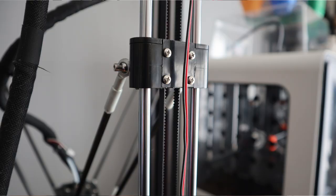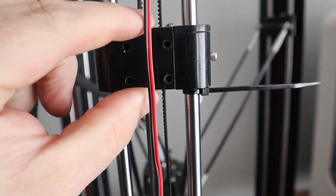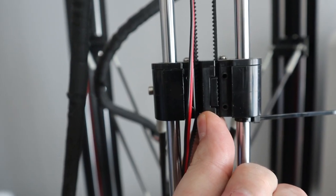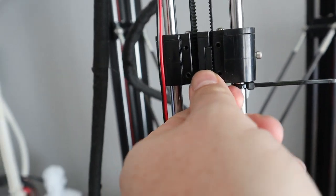Once that is done, there are four screws facing your direction. You're going to need the Phillips screwdriver — remove all four screws, but be aware they are pretty tightened into the plastic, so take caution not to damage the screw head. Once all screws are removed, you can remove the black plate. This is both the easiest and the hardest part, because you have to remove the timing belt. On one of the three carriages, the timing belt was pretty stuck in the grooves of the carriage, so I removed the bottom side first.